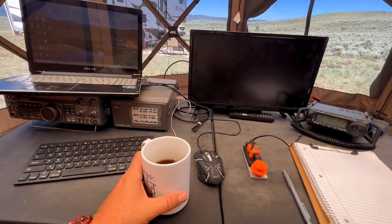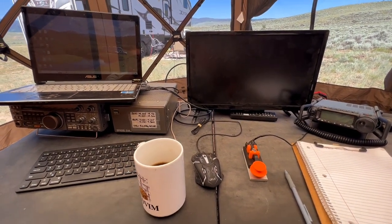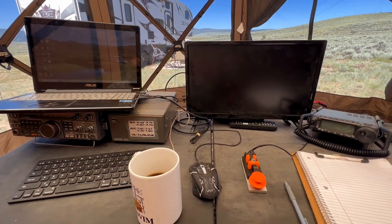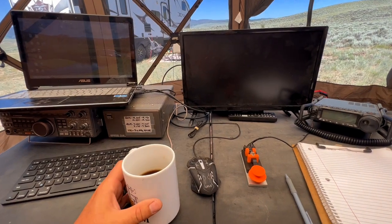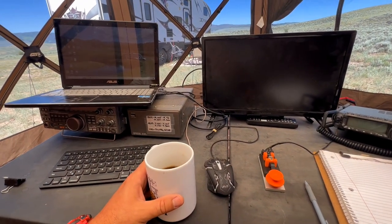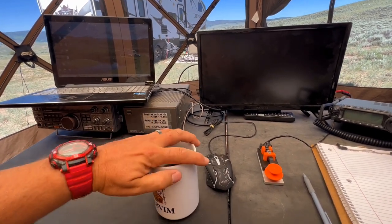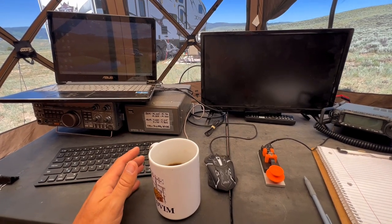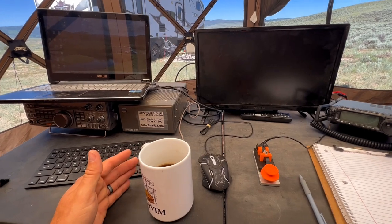The other half of my strategy involves running five watts. I'm going to try to avoid the big fray — I don't want to be on 20 meters in the late afternoon when it's wall-to-wall solid powerful signals and huge pileups, trying to sneak in with my five-watt signal. So I'm going to try to be on what I'd call shoulder bands. If 20 is the hot band, I'll be on either 15 or 40. I also don't want to be propagating into the densely populated parts of the eastern half of the United States.